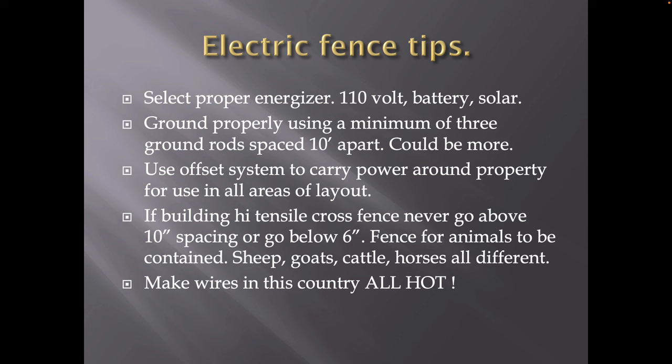Question: if you're grazing multi-species, would you need two offsets? No. If I was grazing multiple species like sheep, goats, and cattle, I would just kind of split the difference. Because once animals get shocked, they think it goes clear to the moon — they have no idea. If they see a wire a little further up, like a fixed knot wire, they have no idea that it's not hot. It's kind of like me or you — if we touch a hot wire and it hurts, I'm not going to grab more wire to see if it's hot. I would look at where the pressure points are on the fence. A lot of times in the winter, you can see where cattle have rubbed. Goats are bad about climbing — they'll climb a fixed knot fence just like they would a ladder, so you've got to space those things accordingly.